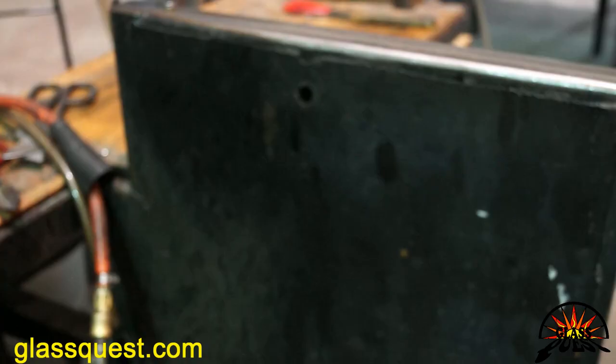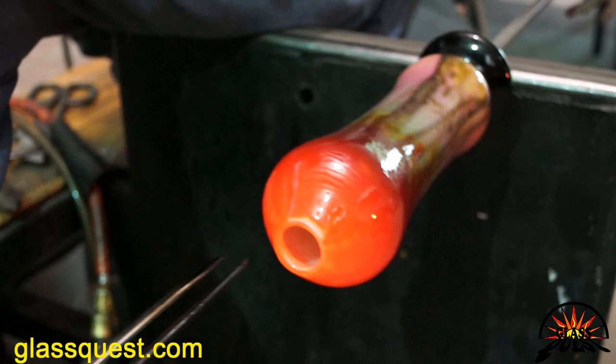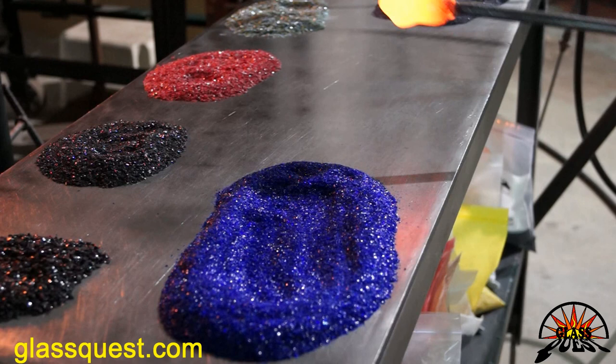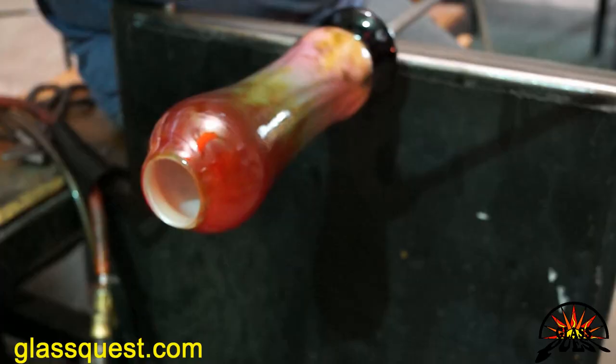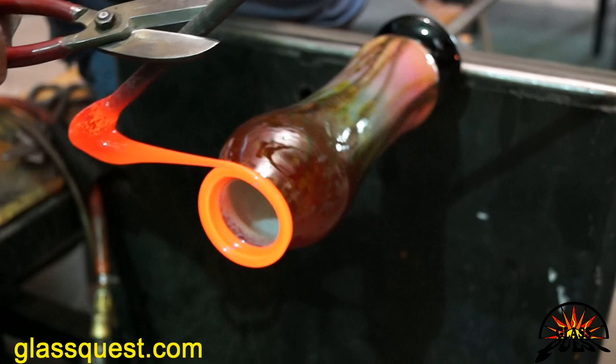Here we go — get the top of the vase hot. You can see where it's hot, just about a third of the way down. Open it up a little bit with the same tool we used to squeeze it down, just using it the other way to open the piece. Here I am getting some blue glass — it's going to be what's called a lip wrap, just shaping it here so it'll come off the pipe nice and even. What teamwork — takes two. Using that same jack tool to open it and make sure it's nice and flat.